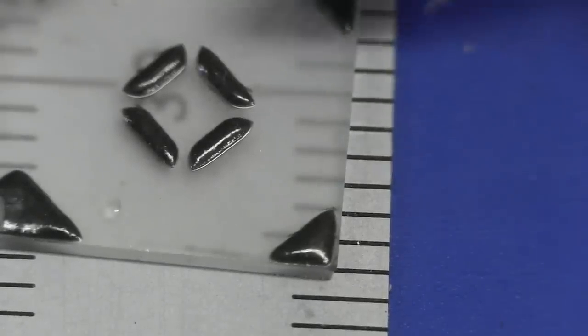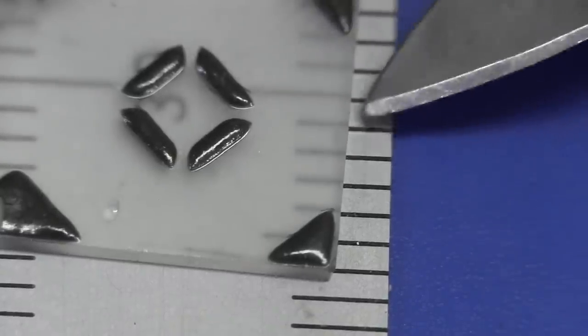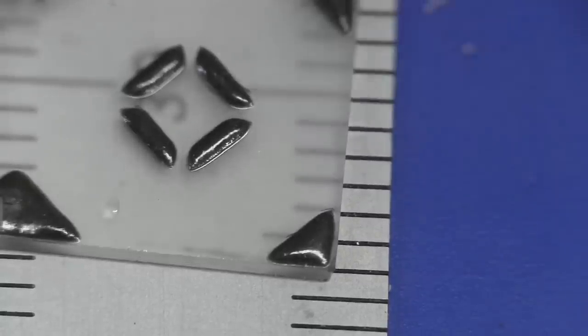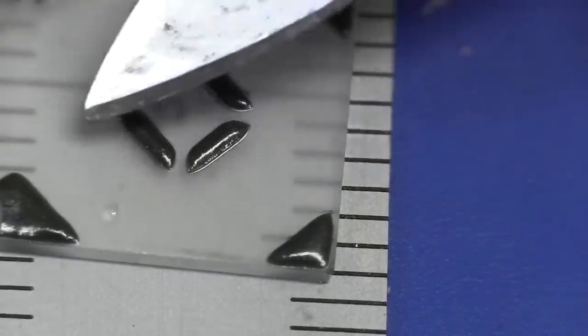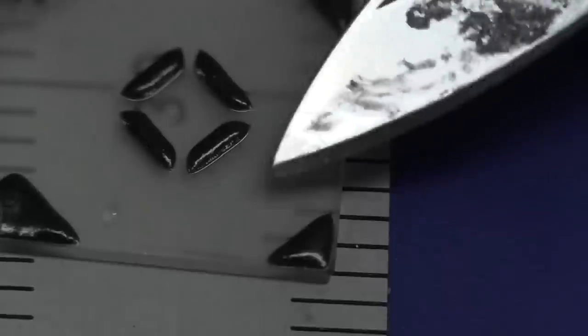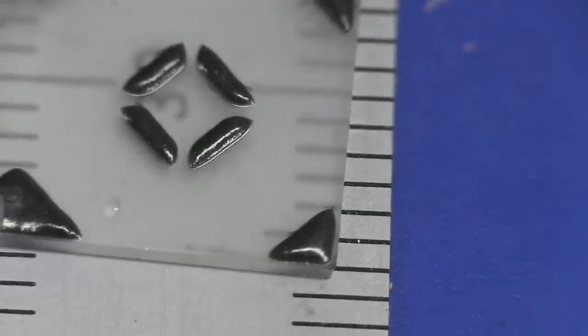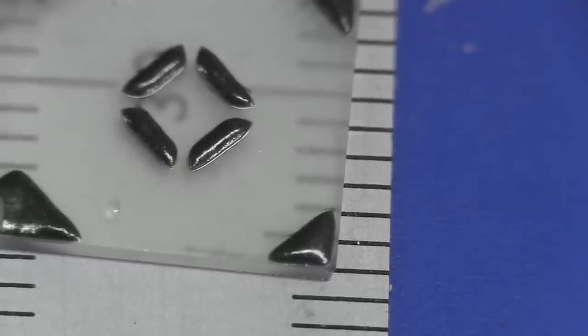For this to be a very good transmission line, they need to treat that surface and have a very good reflection off these edges, because you're going to get a loss at each edge. Because this thing bounces around a dozen times off these various oblique edges — bouncing off 45 degrees, going across, up like that — a dozen or so times. It's a wonder these things can get through with the fidelity that they do, but they've been specifically designed and engineered to be high-fidelity transmission lines. Fascinating.